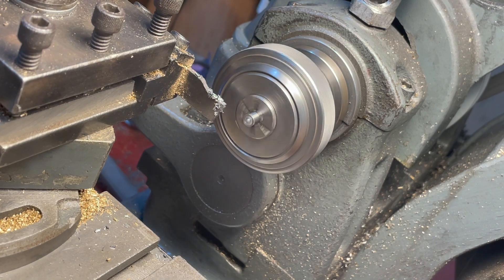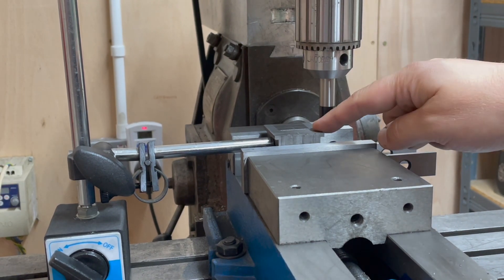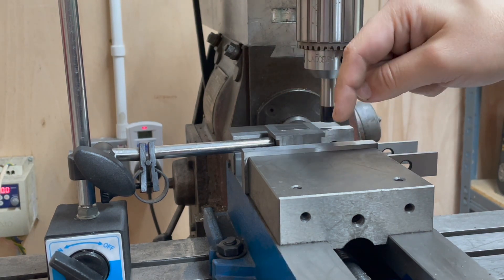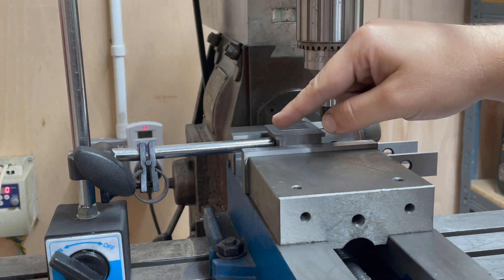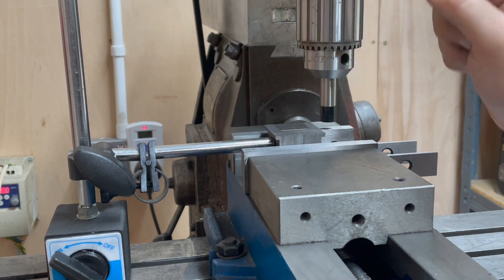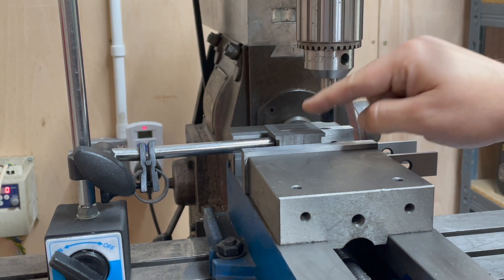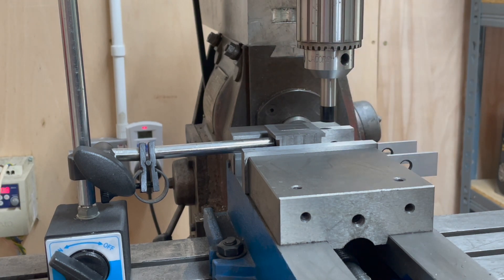For the sake of this video I was trying not to get my hand in the way - now I've got to dig it out of the swarf. Here's my setup for drilling these. I've got my edge finder here. I'm going to find the edges and get this bang on this line here and then halfway down the middle. I've got my parallels underneath and a stop here so I'll be able to drill through. I'm going to start off with the recommendation by Curly Lawrence, which is to put an undersized drill bit for 3/16ths and then ream 3/16ths. Then you can use a 3/16ths piece of silver steel across the frames and make sure everything's free running, and if not you can drift the holes. It doesn't feel very model engineer-y to me, it feels more like woodworking, but apparently that's how he suggested to do it. So who am I to second guess that guy?